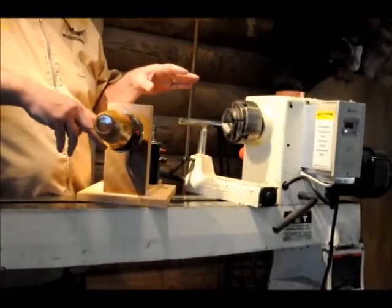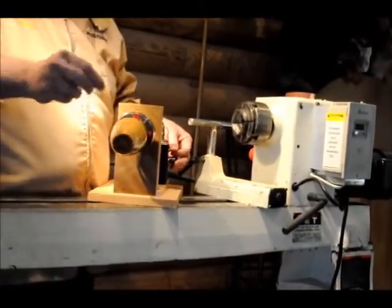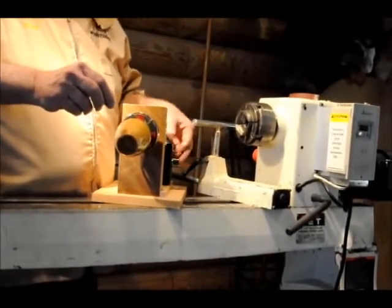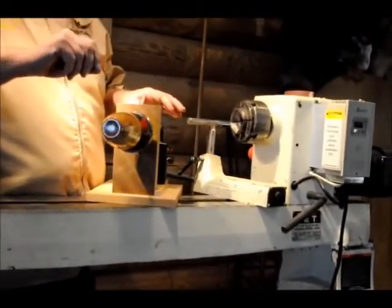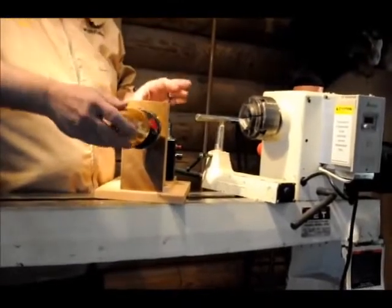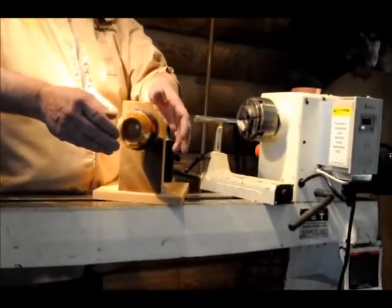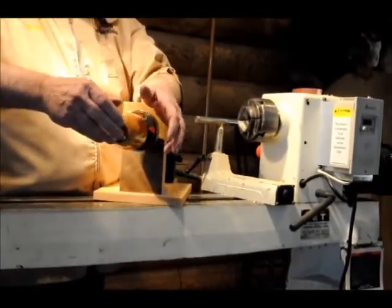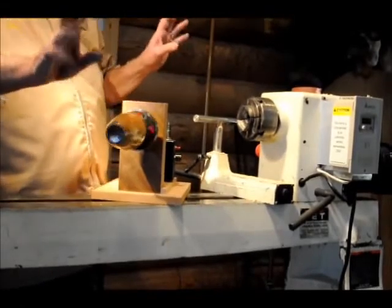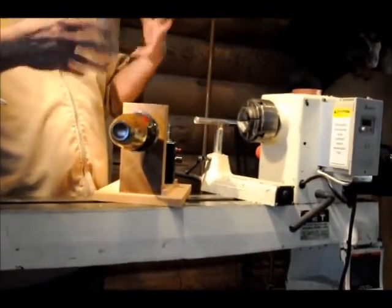If there's some bubbles in it, I may stop it and pop the bubbles with the corner of the brush. Or you could take a really light hot air gun and pop the bubbles with that, a long way away. Will alcohol pop the bubbles? You don't want to put alcohol on it. It's a paint thinner finish. So for the bubbles, you want the air to do it, or the corner of the little brush while it still hasn't set up.